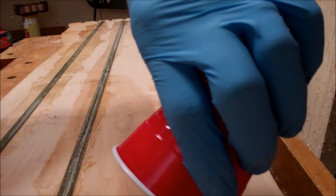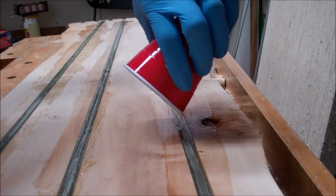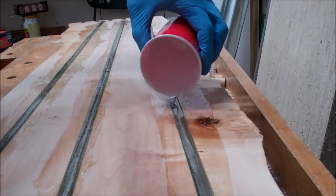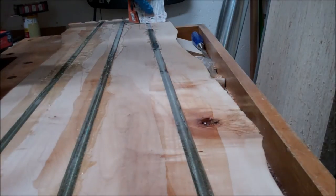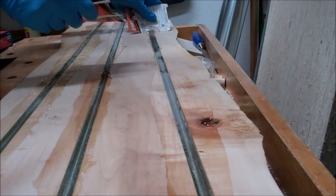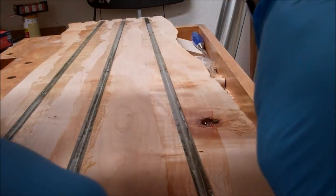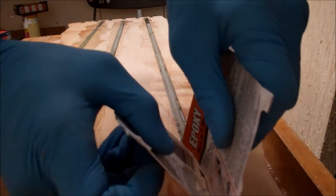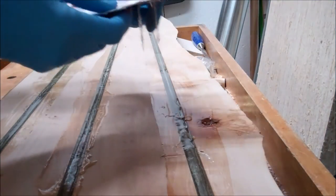In this case, the epoxy is going on the bottom of a bench, so it's going to be very hard to see and it doesn't really make a big deal. But I would recommend putting less epoxy in the beginning than I did in this video, and putting more epoxy in at the end, so that it makes less of a mess during the process but leaves a nice crown over the threaded rod, so that when you do sand down you can control the finish.